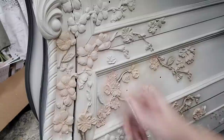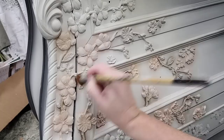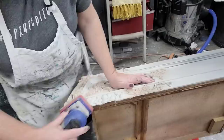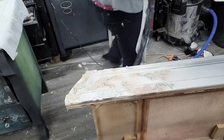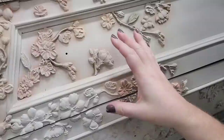The artisan powders are from Prima Marketing but not in the Redesign line — they're considered a mixed media product, but I love using them on furniture. With my powders done, I pull my drawers out — probably should have done this sooner — and take my SurfPrep sander to sand those edges where I cut my molds, making sure they're nice and smooth. Make sure your glue is nice and dry and adhered before you do this, and then just touch up the edges with a little bit of the coordinating paint color.